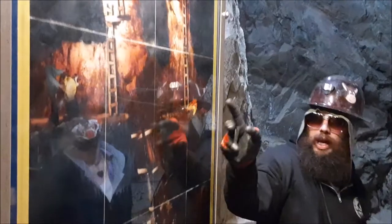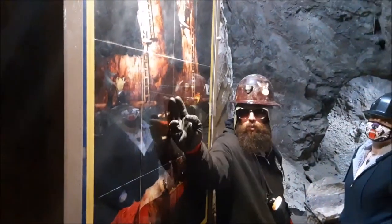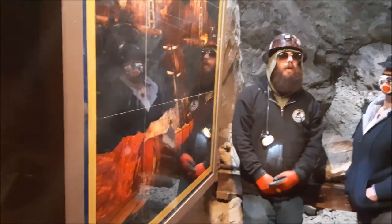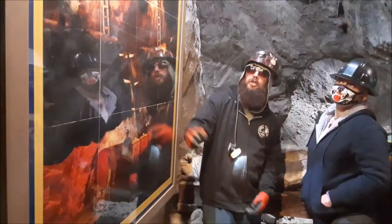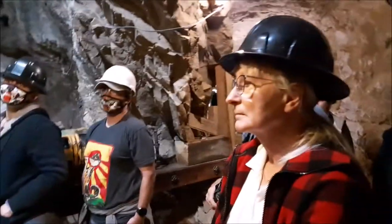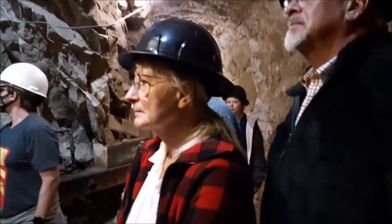They'll come down around those platforms, land on the level below where they have slusher buckets waiting for them. And using those slusher buckets, you can push all of that fallen rock down to this ore chute where it's going to automatically load up in an ore cart. So when we have a fully formed stope drilling operation, just like you see over here, no one's using explosives, and no miner would touch that rock with their hands until it makes it above ground to the surface.